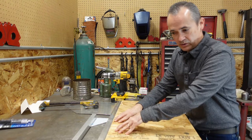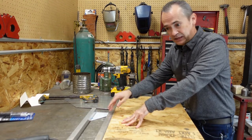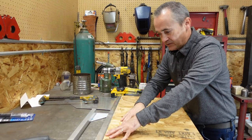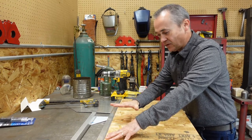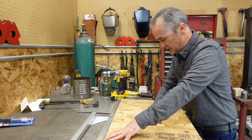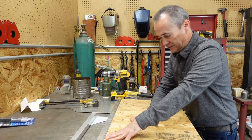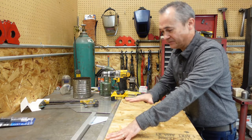Because this is three quarter inch OSB the height of the aluminum is one inch and the aluminum angle is an eighth of an inch it leaves you an eighth of an inch that this is proud of the frame which I like because then I could fill this part with a hard rubber surface so that way it's comfortable to work with and then gives you each layer a little bit softer and then the cushion on top hopefully gives you a nice effect that gets stiffer as you go down.